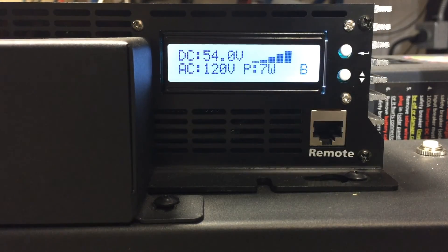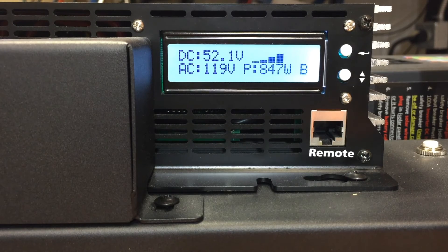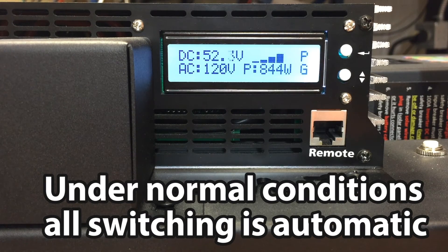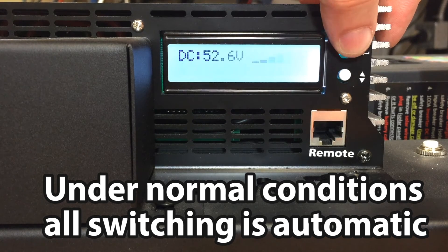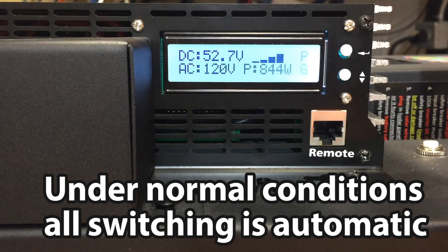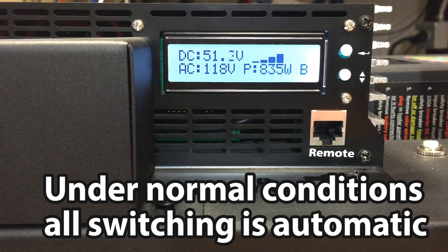Let's put a load on the system — we're consuming 851 watts. When the sun goes down, it'll transition over to the grid. 'P' stands for phase alignment, which is a diagnostic. 'G' stands for grid or generator. When charging batteries off the grid, if the grid fails, it immediately goes to batteries with the same load. When the grid comes back, the system automatically phase-aligns, switches back to the grid including all loads, and starts charging the batteries again. The next day when the sun comes up, the system recognizes the solar power and switches back to battery, which is solar power.